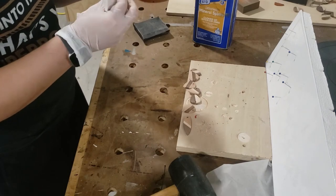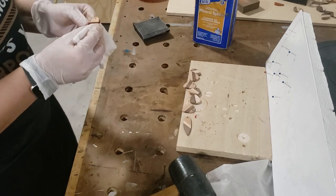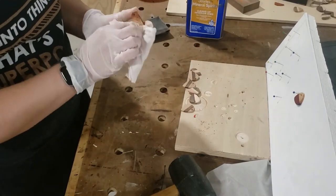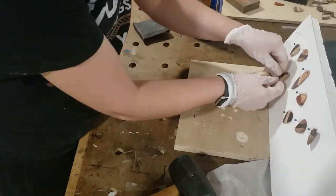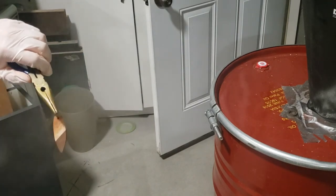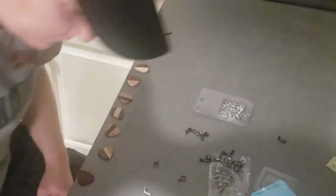I'm just getting the dust off with a little bit of mineral spirits, then hanging them up on this foam insulation piece — a little pin works really well to allow them to dry. For these pieces I'm just spraying them with a little bit of lacquer. I've used a lot of different finishes on the jewelry over a couple of years of making it, and it really doesn't matter as long as you get it sealed up nicely. I also hit it with a little wax after — you can use Danish oil, lacquer, any poly finish, whatever your preference is.